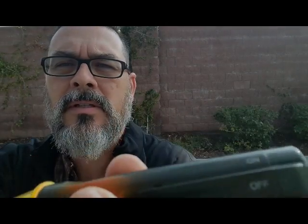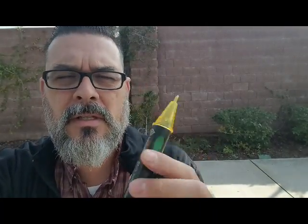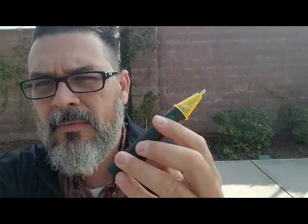This one has a little on/off — this end turns and turns it off and on. Some of the newer ones have a button for that. But anyway, it's just a safety tester — good to have in your pocket or toolkit. The misconception is that this does not replace the multimeter. The multimeter will give you a specific voltage number. If you're troubleshooting, this is just the most simple device to give you a rough idea of what's going on in the circuit, but it doesn't give you the same information and does not replace the multimeter.